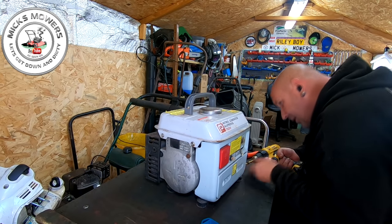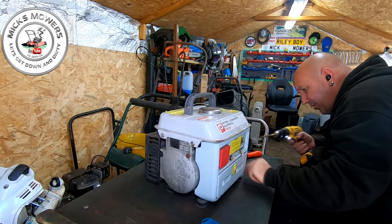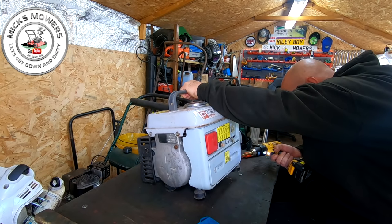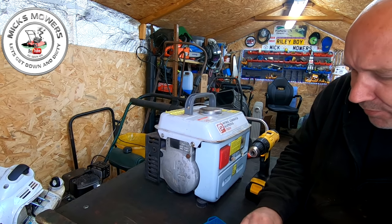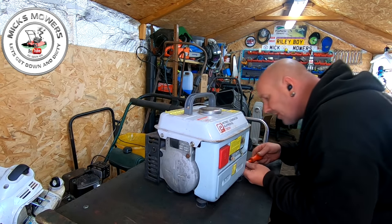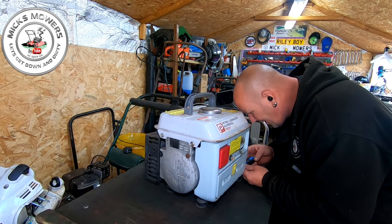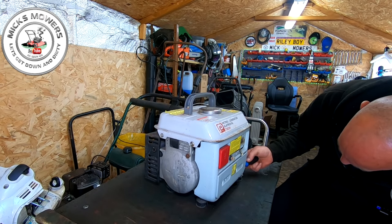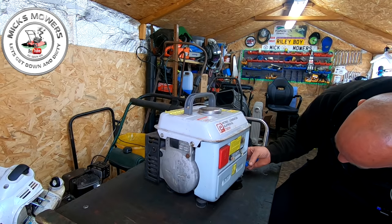I'll just line it up roughly where it is — it's going to be about there, right down the bottom. Just literally drill a little tiny hole just in the side of this casing, just so I can access the screw hole for bleeding purposes. There we go, just a little tiny screw hole. Sometimes these little gravity-fed generators need a bit of fuel assistance. Now I'll get my screwdriver in, line up with the hole — it'll be a flat head — and I'll get a little flat head in there, line up with the carby and just unscrew that. I've got fuel coming down — I'm going to drain some of that fuel out, it's yellow as anything.